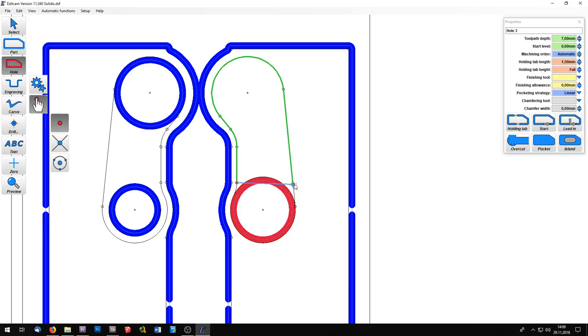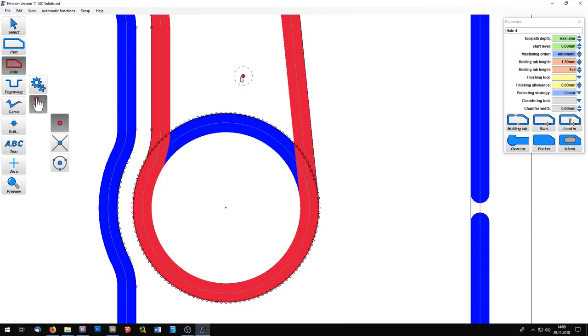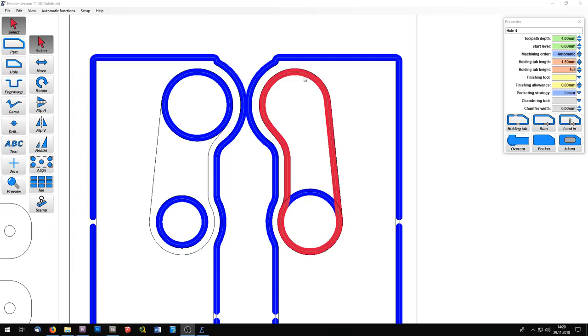This part can be done with a right click automatically. And then I will have to go on here with the left mouse button, and here I can use the right mouse button again, here again, and the last points I will set here. So we have defined the shape, and now I will say that this should only be 4 millimeters deep. But I don't only want to cut out the outline of this hole, I want to remove all the material inside here. And this can be done with a pocket.